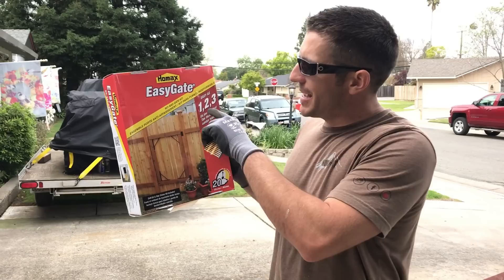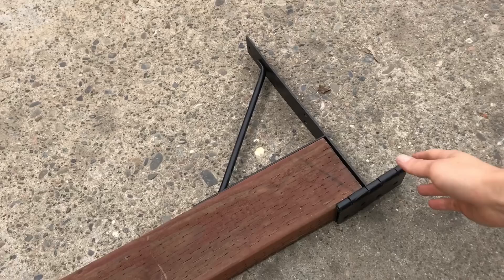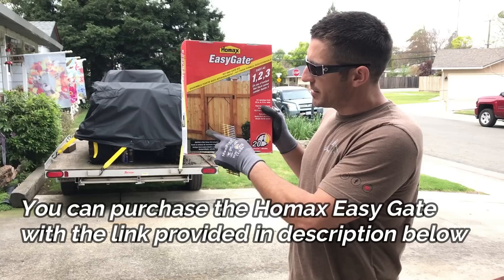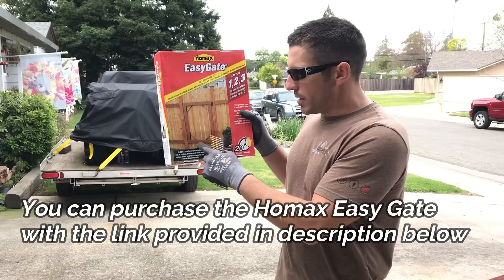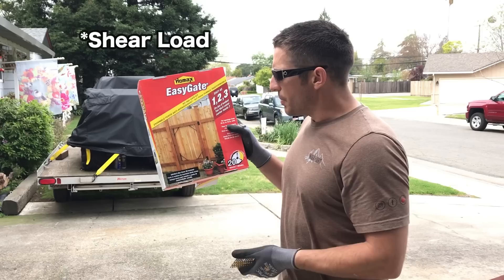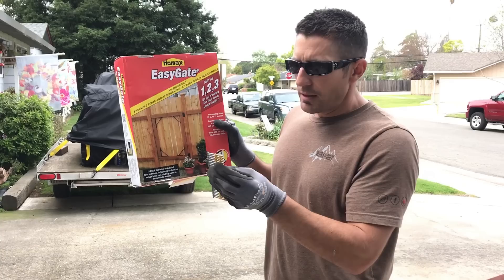This is the HOMAX EasyGate system we're going to install on our gate — it prevents gates from sagging. I found this is a pretty good deal considering it comes with the hinges, and hinges and hardware are always expensive. This was $35. Alternatively, you can run cable anti-sag kits corner to corner, cut 45-degree pieces of plywood for the corners, or put brackets — there are different ways to handle the shear tension. But we're going to use this system and fasten our boards to the 2x4s with a 2-inch ring shank galvanized nail.